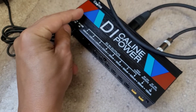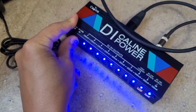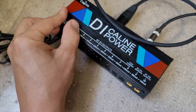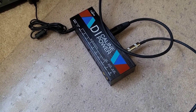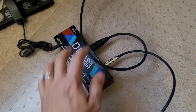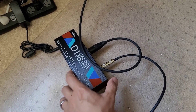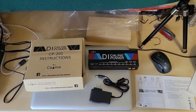As I mentioned, the circuit design is not great — there's no isolation in here. When these lights are on you're actually getting some background noise in the XLR, so there are further flaws in the circuit design on this particular pedal power supply. That would not make this very good. They just unfortunately poorly implemented the DI feature on this power supply, so thumbs down for that.